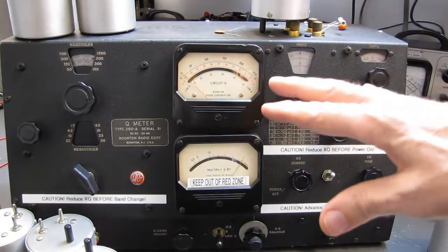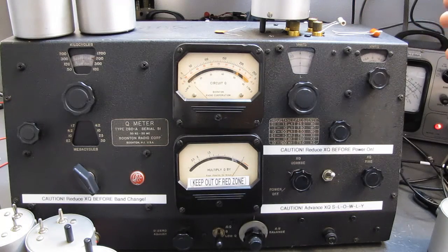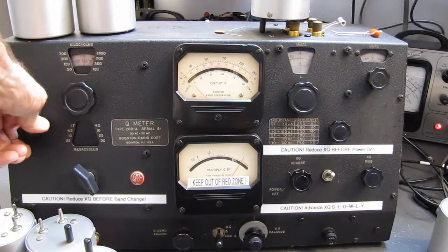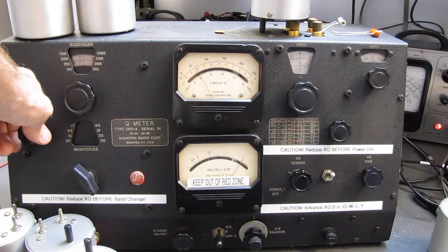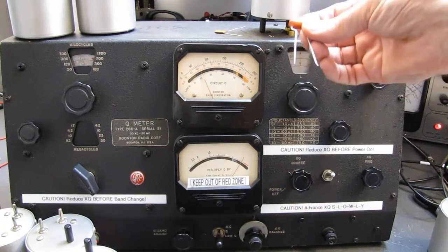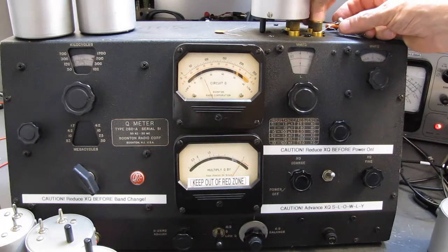Now I'm going to have to retune a little bit. These capacitors, while they are the same marked values, this circuit is sensitive enough you have to repeak it. And I've just got to find where that one, there it is. Okay, the other one was 80. And here's where I would have lost my paycheck. This is 72, 73 versus 80. So the orange drop is actually a better capacitor than this glass tubular, which shocked me.